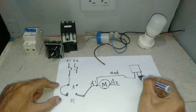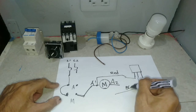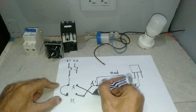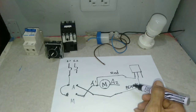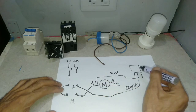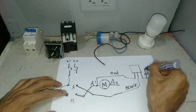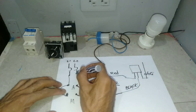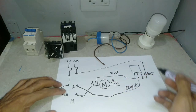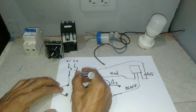From the two black wires of the photocell to make auto mode. And the white wire of the photocell will go to line 2 of the MCB. The A2 of the coil will go again to line 2 of the MCB to make the circuit complete.